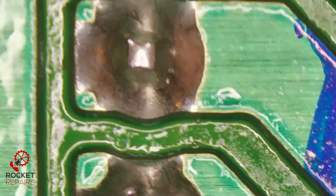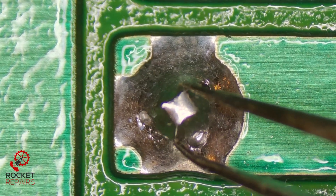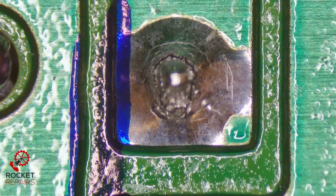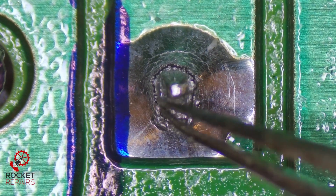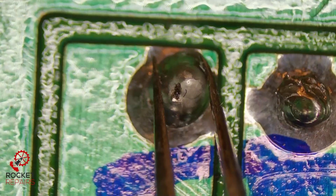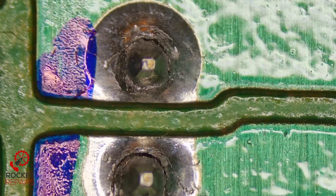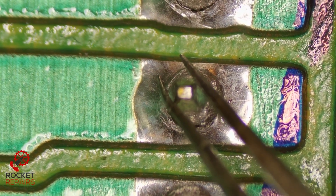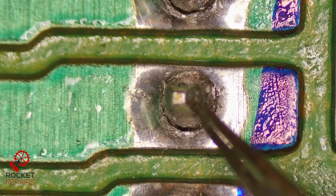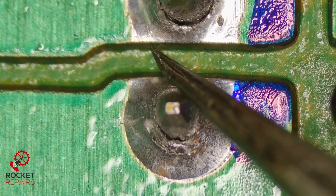I'm going to show you something under the scope — I love the quality on this camera. These are the very small solder joints that I just showed you. Majority of these look okay, they don't look too bad. This one isn't in fantastic shape, but it's still soldered. If I show you some of these joints which have been marked — for example, this one — you can see that the solder is cracked around the actual pin, and you might be able to see just a little bit of wiggle there. It's not just that one that's affected. This one isn't soldered very well because it's more like a cone. This one is also not looking that great. These ones are specifically on the bend where the board bends, and look at this one as an example: you can see that the pin itself is coming away from the trace, and it's not just one — we have a whole row of them here. Even though I'm getting continuity, these are clearly not soldered that great. They're soldered from factory, but they definitely need a touch-up of some leaded solder.